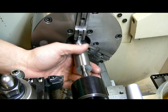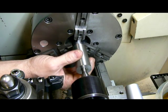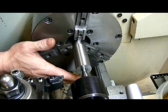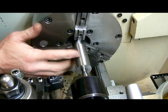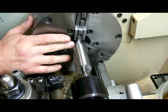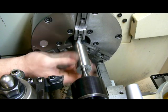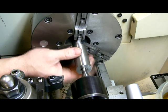As far as this being true right now on the outside diameter, I'm not worried about that because all my trueness — what I need to be true with — is with the bore of the rifle when I put this on there. So this is just a roughing pass. I'll get it down to one inch and then we'll take it over to the mill.